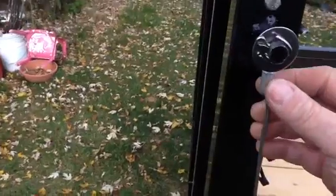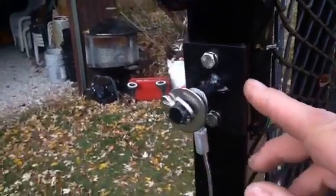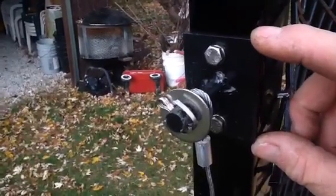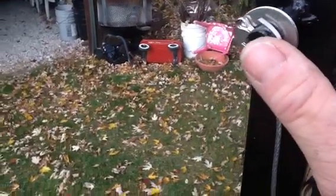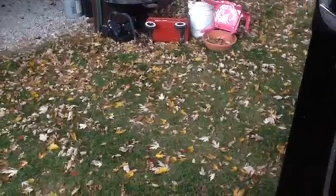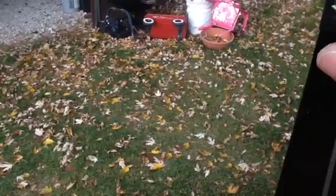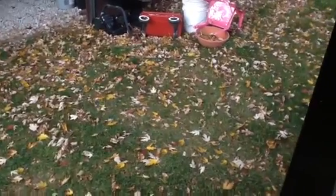These are the cables normally used on garage doors with the ferrule on them. I made this connection point here — it's nothing more than a piece of 2-inch by 3/16ths steel with a piece of 1-1/2 inch round stock, 2 inches in length. I drilled a hole through and plug-welded it, then put a couple support welds on the outside. Then I put a 1/8-inch hole through the center along with a 1-inch washer and a cotter pin, all stainless steel hardware.